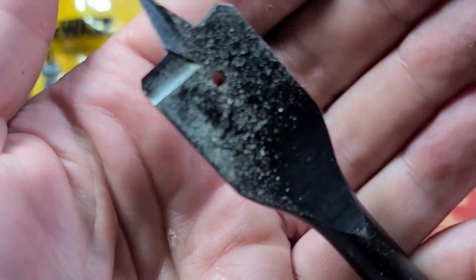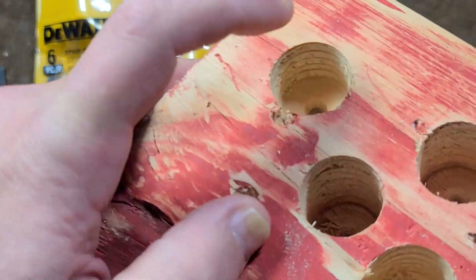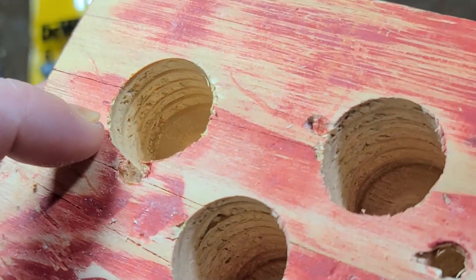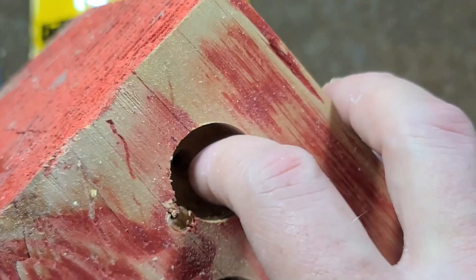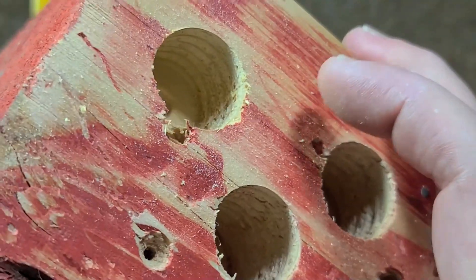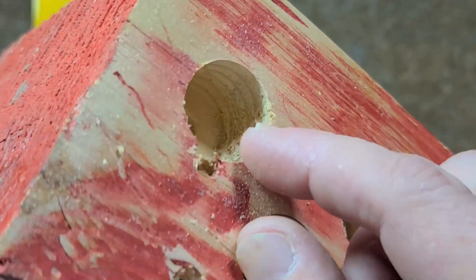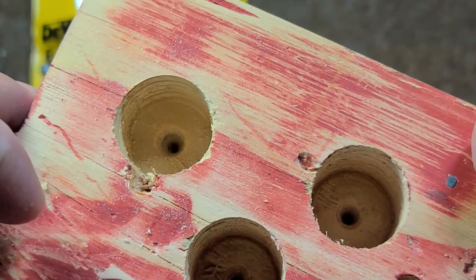The bit seems absolutely fine after just a couple of short holes. These two outer holes are the ones I just drilled with the DeWalt — it actually has a pretty good finish, pretty smooth. Spade bits often really tear up the hole with a bunch of torn material where it's pulling apart rather than shearing. Going across the grain tears it up a little more, while going with the grain it's smoother, so there will be some inconsistency in every hole, but this is not bad at all.